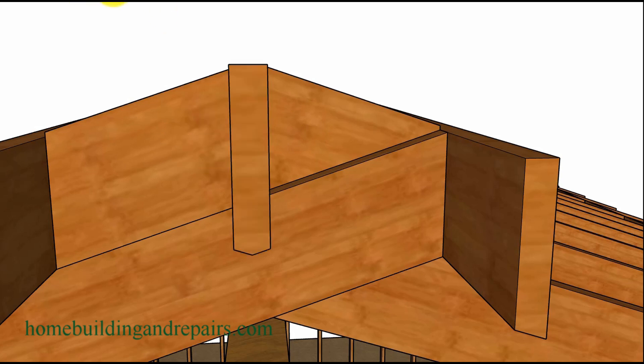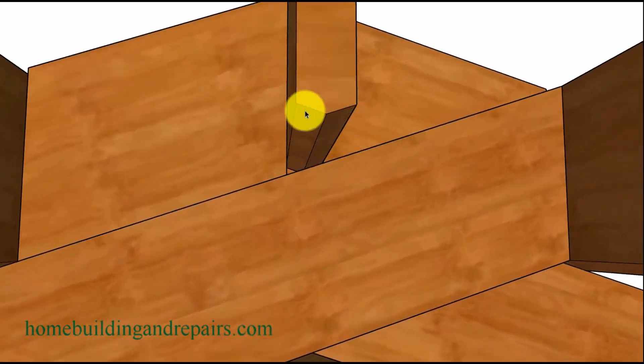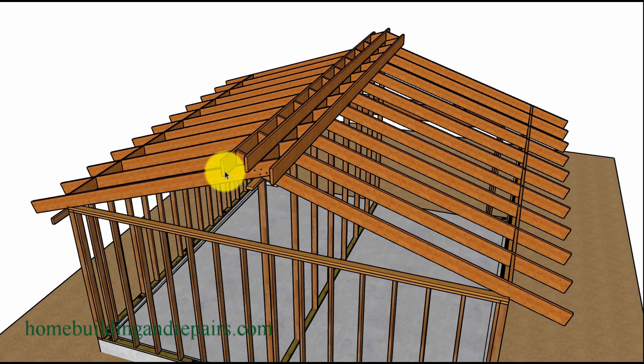We'll go ahead and throw the ridge in. That's what it would look like without all the rest of the fill rafters. I did shape the bottom of this one — you don't need to; I'll leave that up to you. This is designed to fit in between the rafters here. The extension on these boards — you can run it a little farther than you need to; if you don't know the length of your fascia board, you could always cut these off later. I like to have a 12-inch overhang, and if I subtract for my inch-and-a-half fascia board, the distance from the face of the wall would be 10 and a half inches. Since this rafter is set back, it would need to be an inch and a half longer.